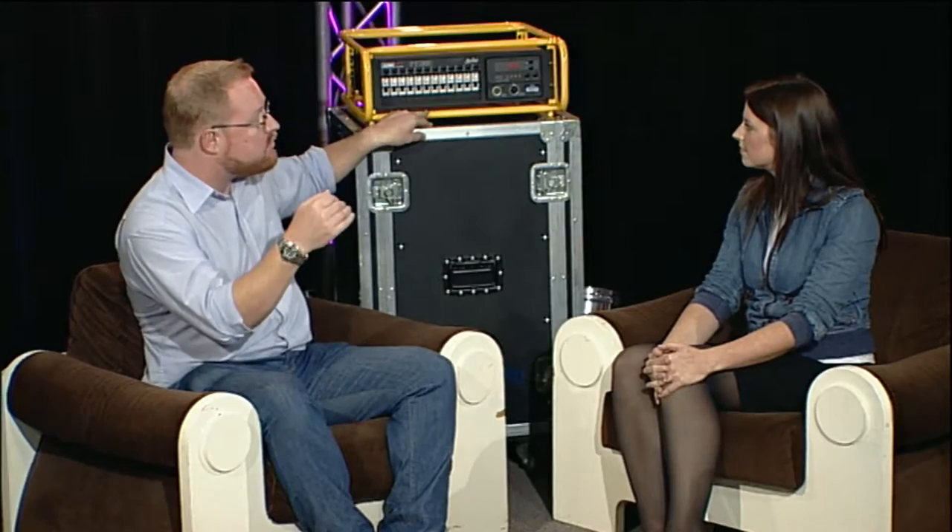The problem is that two of those types — the LEDs and the fluorescence — aren't dimmable, largely. So what happens is if you put them on a dimmed circuit, even at full, you can actually send them a distorted AC wave and possibly damage your fixtures. We're also the Australian Verilite distributor. Verilite is a moving light. If you put your Verilite onto a dimmed circuit and damage it, it's not warranted for repair, and most moving light manufacturers are in a similar position.